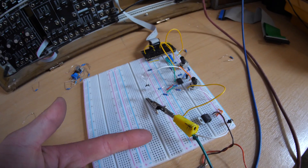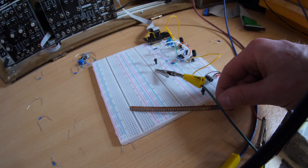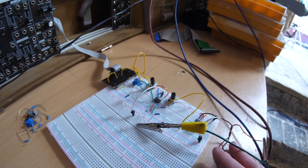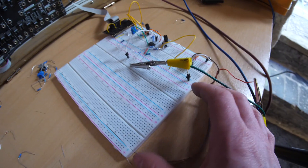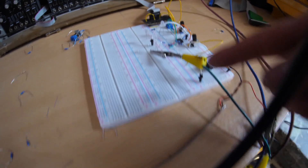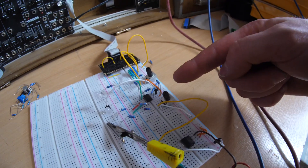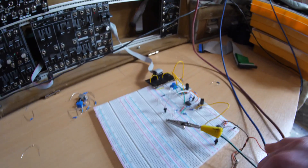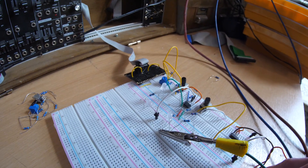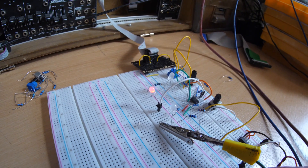The reason I'm not that fussed about these control membranes is that the resolution is about four bits - I may be wrong - so that means there's only about 12 values between extremes, and that's just not enough to be expressive. I've got a circuit right here which I'm going to use for every single finger. It takes the voltage from the finger's pressure sensor - you can see the light every time I bend it. Five volts goes into this pressure resistor, this first bit offsets it to zero, then it gets amplified so that quarter-volt change becomes about three or four volts, lighting up the LED. Imagine that LED as a control for a certain parameter on a sound.